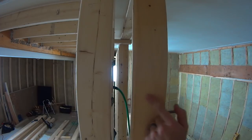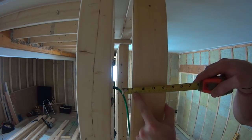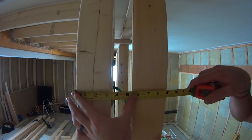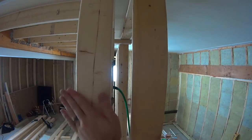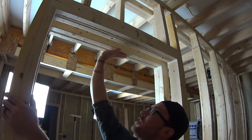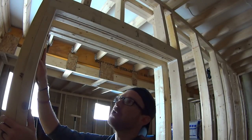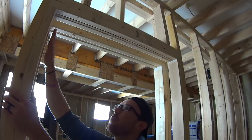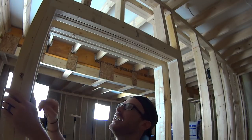This is a three-and-a-half-inch stud, and this is a three-and-a-half-inch stud with a two-inch gap in the middle. They recommend a minimum of one inch between the two studs, so I did two inches. As you can see, we actually have a nine-inch gap total because drywall goes on each side. Because it's two separate structures there are also two separate headers for these doorways. I'm going to connect them using mass-loaded vinyl, because I don't think that'll transfer mechanical vibration from one set of studs to the next.